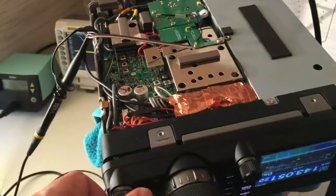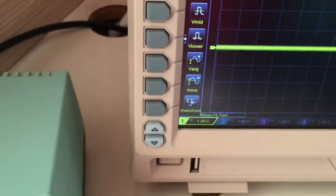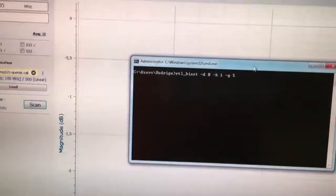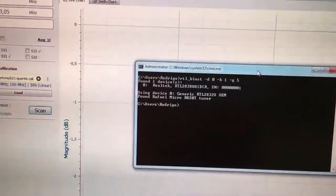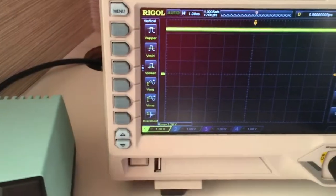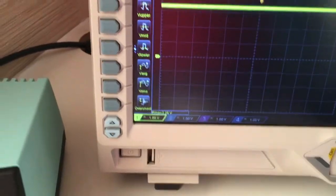Let's see how that translates. Over here we see no signal. Let's pay attention to the noise level as well. I've essentially put the pan adapter out — we got 3.2 volts bias. However, the noise level did not change significantly. Let me put the pan adapter back again.